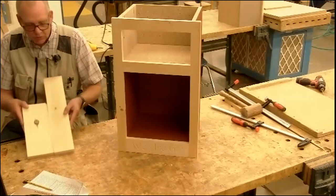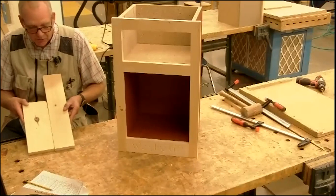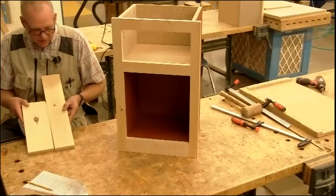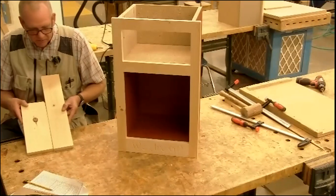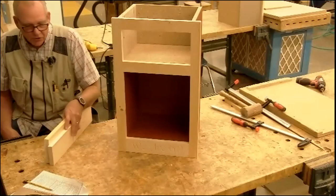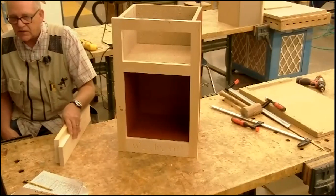So we do a lot of edge laminating here. You would be edge laminating for your top for your nightstand and possibly for your drawer front for the nightstand, depending on the material you could find for the drawer front. We also do a lot of face laminations here. Usually what we do for face laminations to make a thicker board